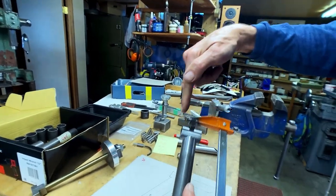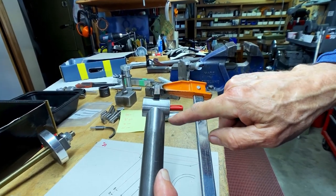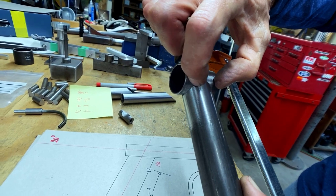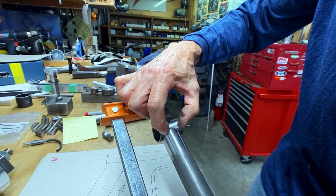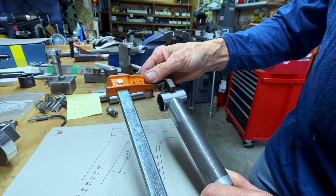What I'm looking for here is the right spacing — I want equal spacing on either side. And when I've got that, a little TIG weld there, a little TIG weld there, just about five eighths of an inch. Then after that, everything is fillet brazed.